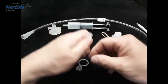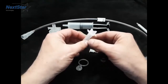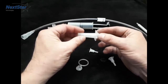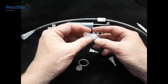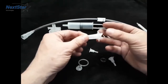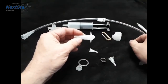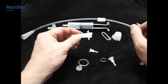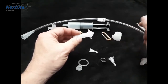We have a corner port — these are designed so that they fit into a 90 degree corner. If you have a wet wall, we have a method now of using KD2 Blitz powder — it's a super fast setting concrete. You can drill a five-eighths inch hole, warm these up in water and bend the tabs back, and this will pound snugly into that five-eighths hole. It only has to be an inch deep and stay there all on its own. Then it's easier to seal around it with a paste, hydraulic cement, or the KD2 Blitz.